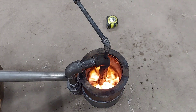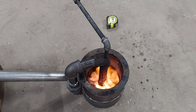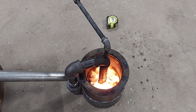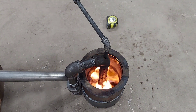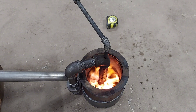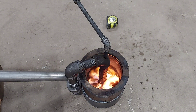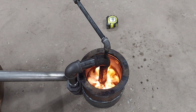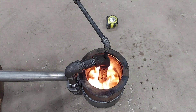I'm just going to let it go real time so you can see how quick this one lights. With these oil burners, just when you think you know what you're doing, you figure out you don't — that's pretty much what happened in that last video. This is running on waste motor oil this time because I'm never going to be able to use waste vegetable oil — it's way too cold here in Michigan. I set it in the back room which only gets down to about 50 degrees, and it turned solid white, so that tells me it could never work outside for me and I don't want to spend the energy heating it just to keep it liquid. It appears to be taking off pretty good and I haven't seen any smoke at all yet — that's real good.